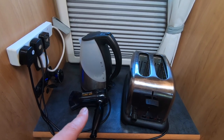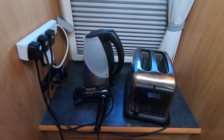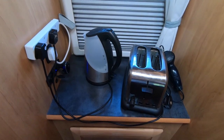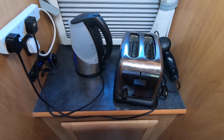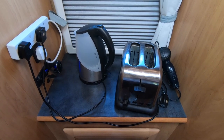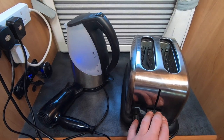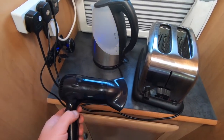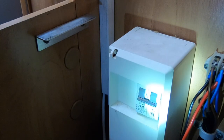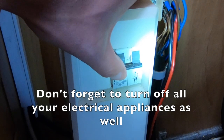You could be running a hair dryer, your kettle, a toaster and maybe even the heating — everything mounts up and overloads the system. When that happens the MCB trips. I'm going to overload the electronics in the motorhome by turning on all these devices, which is probably what happens to you when you turn everything on. When that happens, locate your MCB and flick the switch back up.